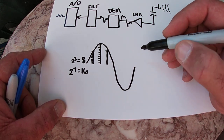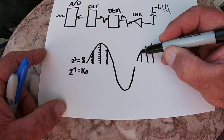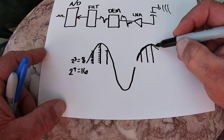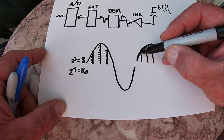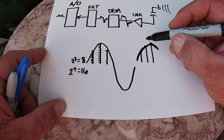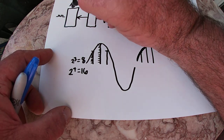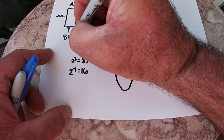So that when you reproduce the signal, you take just a bunch of pulses and you connect the dots. And there's a little bit of quantizing noise that you can't avoid — depending on your sample rate, you can't get it exactly. And all that quantizing noise is less the more accurate your samples, the more accurate your levels are, and the more often your sampling is. So this thing is sampled with a 16-bit A-to-D, and it's sampled at 8 kilohertz — 8,000 times a second.